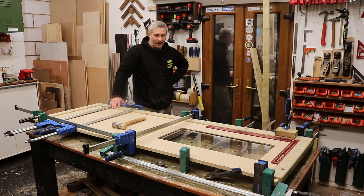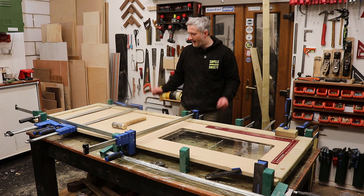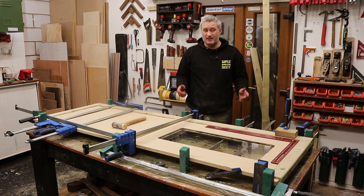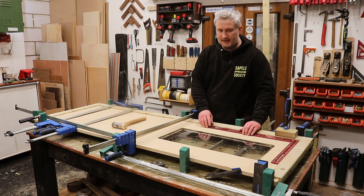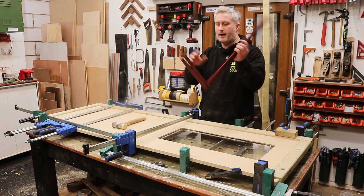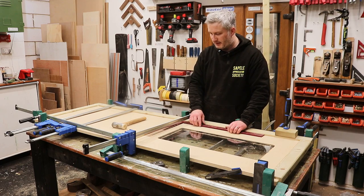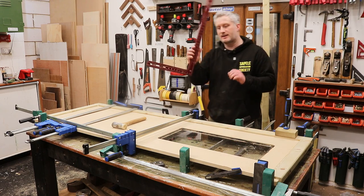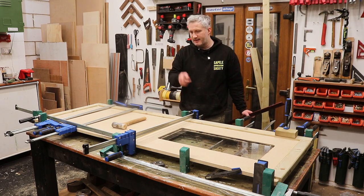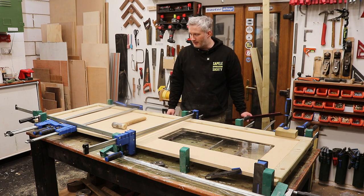So that was an absolute nightmare. I knew it was going to be tricky but I underestimated just how tricky it was going to be. Because this glue sets pretty quick — it's a 30-minute adhesive but it goes off within a few minutes really — I really should have asked for another pair of hands. As things stand I've got everything sitting nice and square, but unfortunately I couldn't get my other upright fitted because the glue was just going off, so I'm going to have to do this in two separate glue-ups. And I'm a bit worried about that because the chances are that my tenons are no longer going to line up with my mortises once all these clamps are off and the glue is dry.